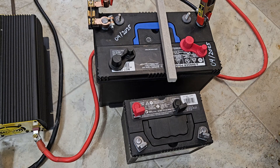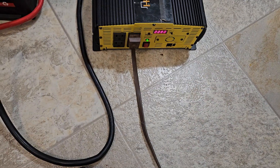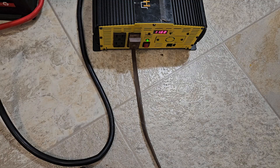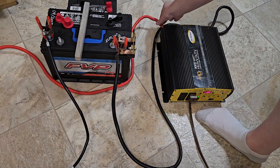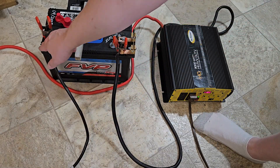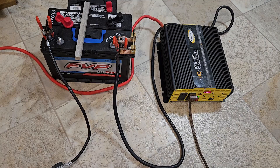The refrigerator just kicked in. Switched to watts — it says it's pulling 80 watts, rounding to the nearest 20. Battery voltage is 11.6 under load, which is somewhat normal; with a big battery or lithium you'd expect above 12 even with the compressor running. After about a minute, check if anything is hot. Not warm, not warm — everything checked out. Recheck every minute for the first 10 minutes, and if you make it past 10 minutes, it's probably good, but check on it once in a while.